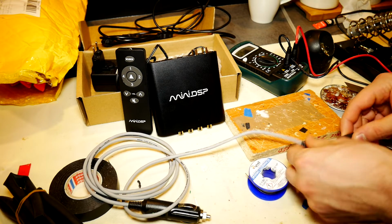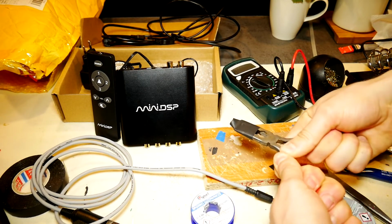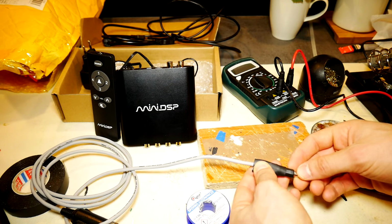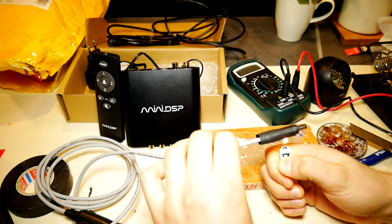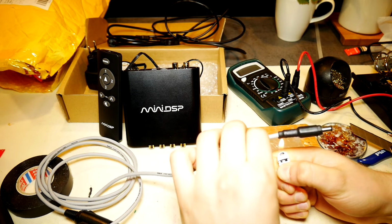Take a slightly smaller tube in diameter and stretch it with pliers, thus obtaining the tighter connection. Heat shrink tube that I used was already with glue inside, but you can use one without glue if you want. Once we have applied it, shrink it with fire or hot gun. This was also the final part of making the cable.